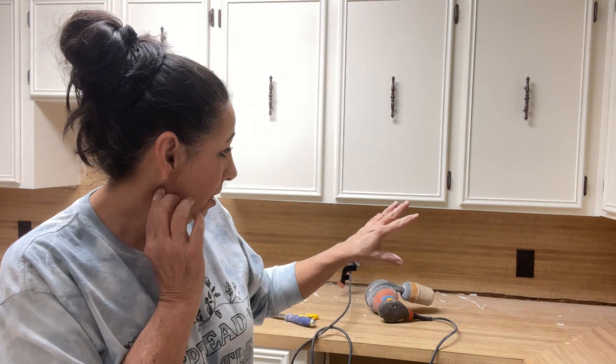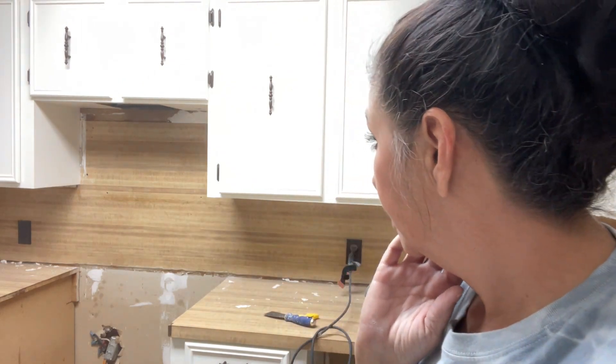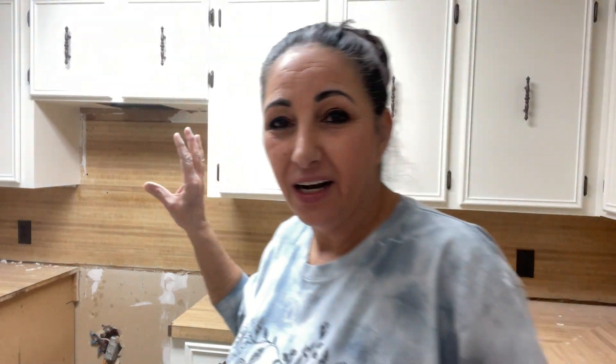But to this video — you see I titled it 'Did I Learn a Lesson?' Yeah, Miss Lippy learned a lesson. A backsplash is going in and new countertops. What I did — I don't know if y'all are gonna be able to see it — see all that white? That was kind of covering the backsplash. Because I thought, I'm gonna paint, I don't have to worry about cutting it in. We're gonna stick some backsplash on it, be good. No, it ain't good. Because you gotta have a clean surface to put glue and new material on to.